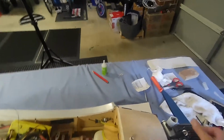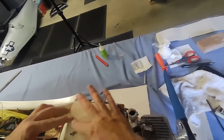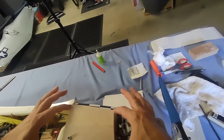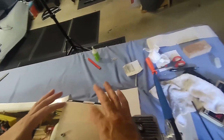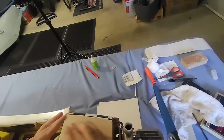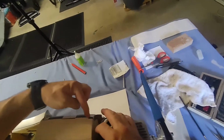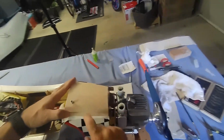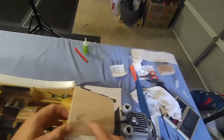All right. Well, that'll do for today. Clearly, I've got to sand it down. I'm probably going to leave this quite large back here, quite thick, and get that very, very lightly sanded, just to surface sand. And then, of course, I'm going to have to feather it in because there is a bit of a gap between the old balsa skinning and the new stuff.